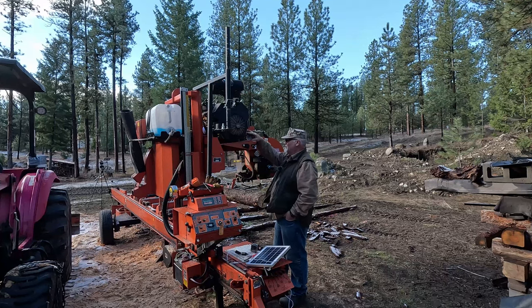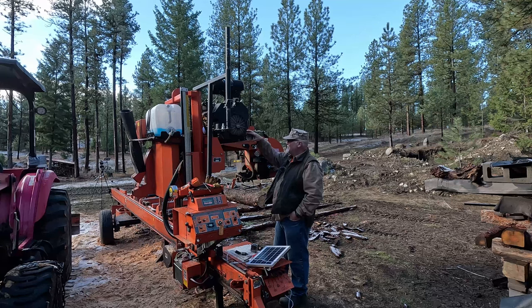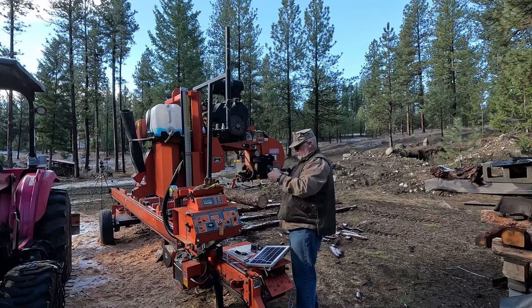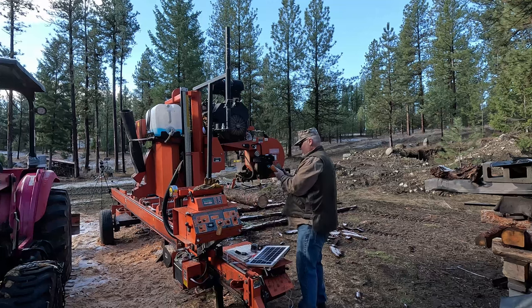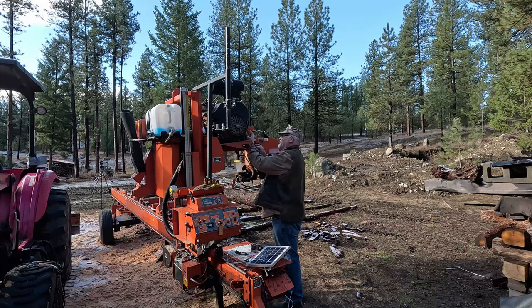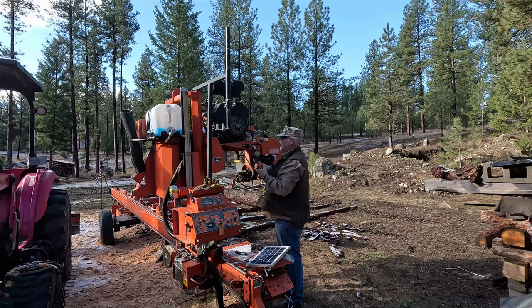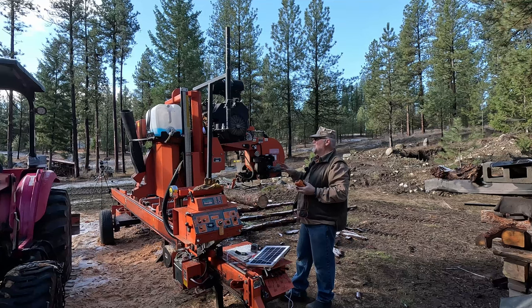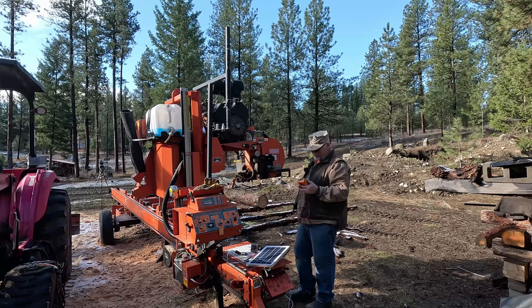I'm not getting a charge off this if I go from the positive terminal on the back to the ground right here. One thing I can check is I should actually have power. If I go like this, put that on DC and connect up here like so, I think I should have power here. I do, 11.98 volts. So that's my positive and negative. So I do have almost 12 volts across these two terminals. And I know in the book it talks about how to check that. There is a way to check that. I'm just not sure without the book what it is. And I don't think I have them here. If I do, I'll have to check, but something's not right.